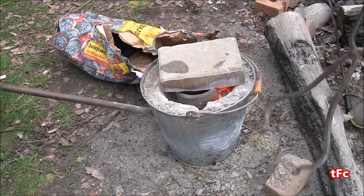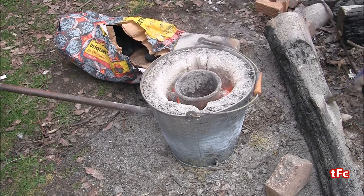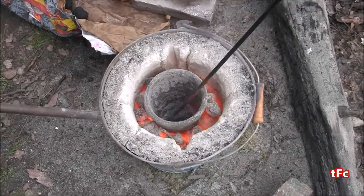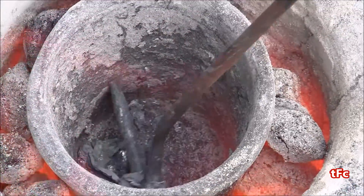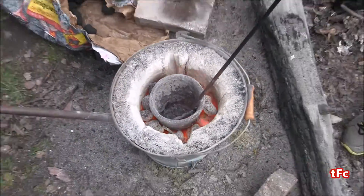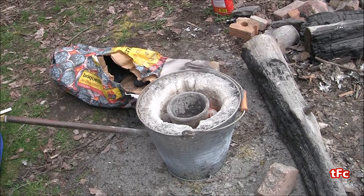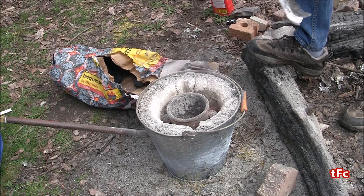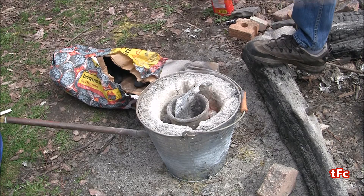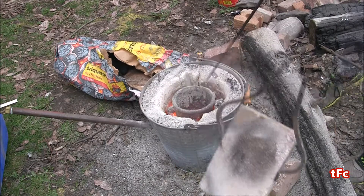Let's check on the pop cans after one or two minutes. Right now it doesn't look like much, but if you look closely you can see a tiny bit of molten aluminum in there. Pop cans aren't the best for melting because they don't produce a lot of aluminum — most of it is just slag, which is material that doesn't melt. So I'm going to add some aluminum scraps; I've already removed the slag from them so they'll melt a lot cleaner.